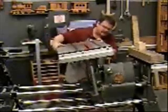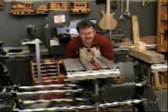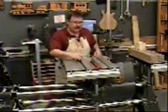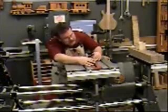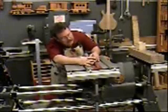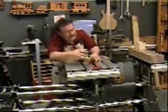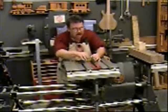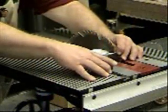So, take the table. Now bring it down to where it is just a fraction of an inch off the headstock. Tighten this up. See how it'll pivot back and forth. Let's find the tooth that we've marked. It's somewhere here. There it is. Okay. Measure here. I'm on number 20. 20 thousandths. And measure here. I'm on 18. All that futzing around has taken this off a little bit.